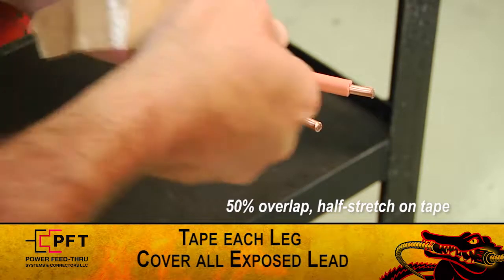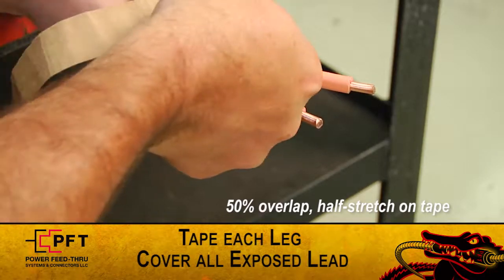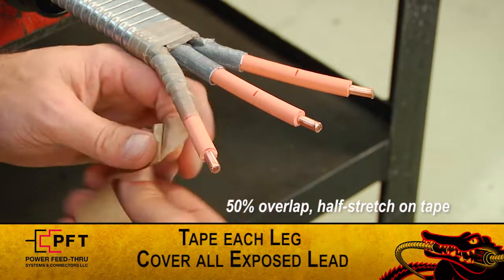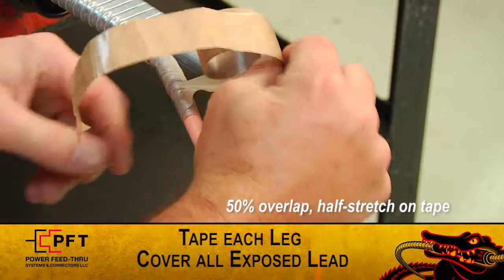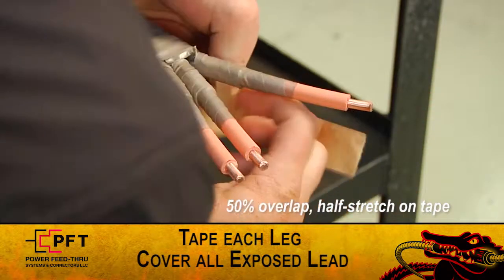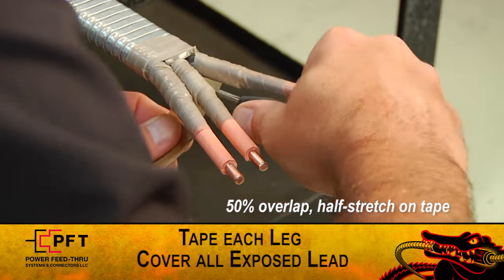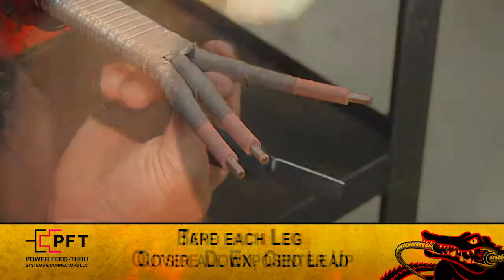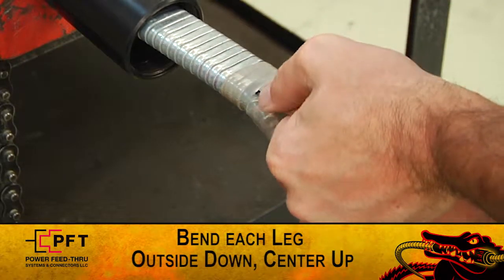Make sure to end with the tape straight up and down, aligned with the tape line mark. Then wrap the tape back towards the armor cut. Be sure to cover all exposed insulation. Note, always apply high modulus tape as instructed, even if lead jacket or barrier is not present. Now cut and remove any excess tape. Carefully bend each leg so that they will form a triangle that the seals will fit over.